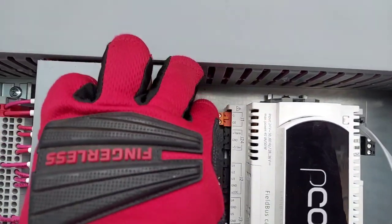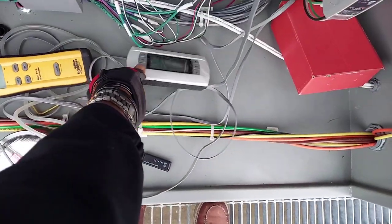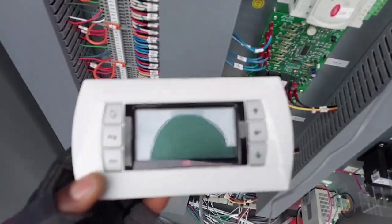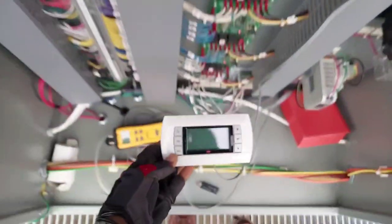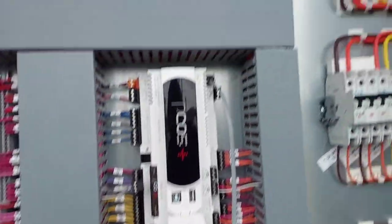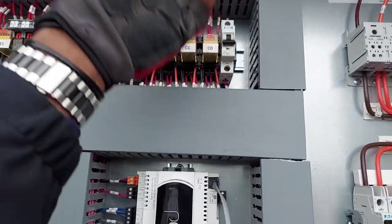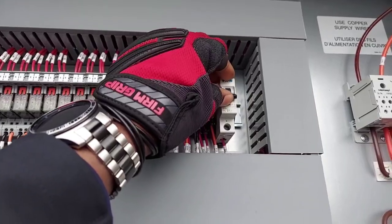It's doing the initialization and now it says 'switch off the unit to confirm data.' So what you're going to do is either unplug the power here or turn the key switch off — this is the power to the controller. You want to leave it powered down for at least 10 seconds. That's good practice — leave it down for 10 seconds and then restart.